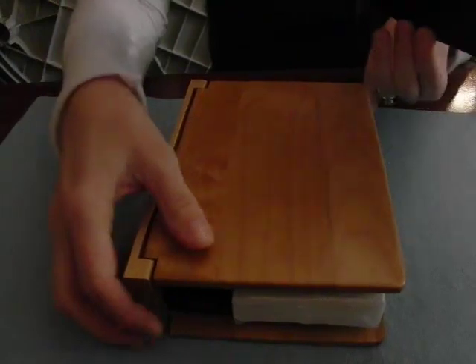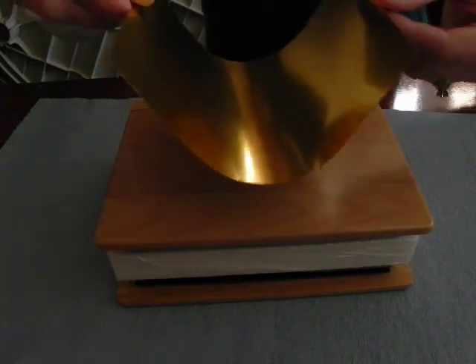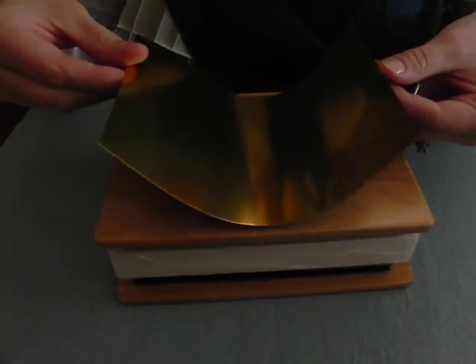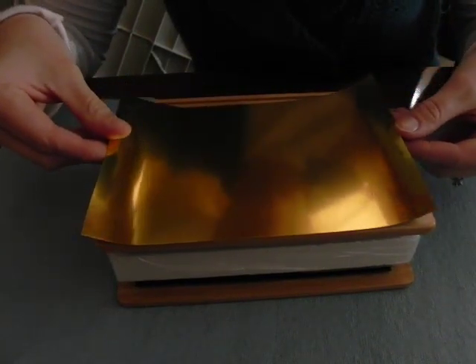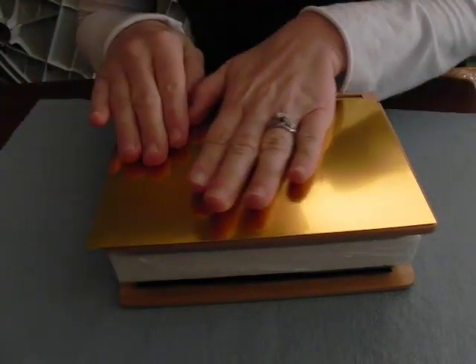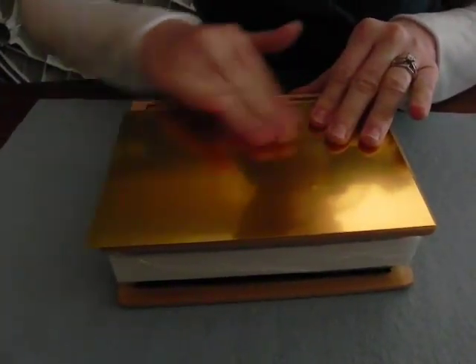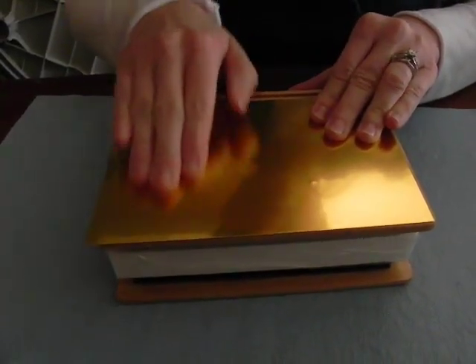I'm folding it and I'm going to roll it out in that nature. I'll go to the center and roll it out carefully. I want to avoid air bubbles, and I'll smooth it down softly at first to make sure I am getting out any air bubbles, then really rub it in so that it does not lift during the engraving process.